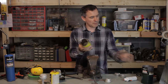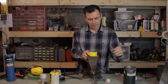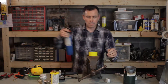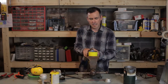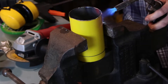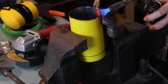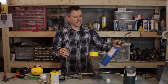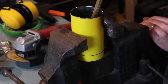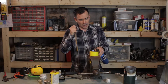The last thing I like to do on my crucibles is just give them a little pouring spout. The easiest way I found to do that is just to stick it right back into the vise again, grab a torch, and then heat up one area — get it nice red hot. And using an iron bar like this one here, it's a piece of rebar — just stick it in there and give it a start bending it. You might need to heat it up a few times to get a good little pour spot on there.